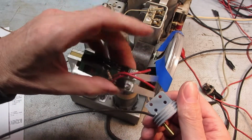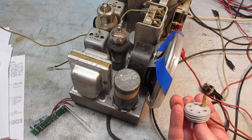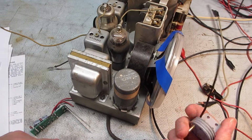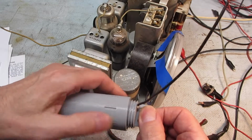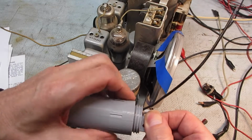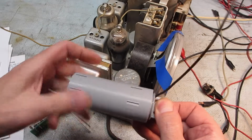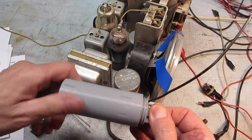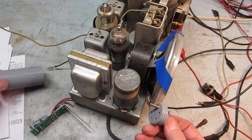I believe I'm supposed to go this way with this. Mount that on with those straps anyhow. Got some brass pins I cut and machined, and I've got to solder up all the other wires yet. The threads go on pretty nice for 3D printing. It goes on pretty well. Obviously I got the screw on backwards, but it goes on there pretty well. This will just socket in the same location as the old one.